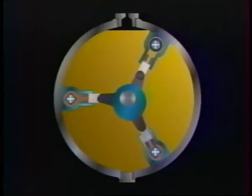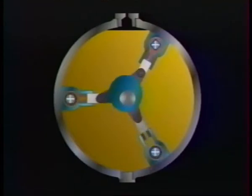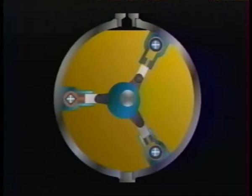The circular crankcase is oil-filled for hydraulic diaphragm activation and lubrication of mechanical parts. The Harben tubular nitrile diaphragm, with its internal supporting mandrel, allows cycling rates in excess of 1,000 per minute and produces a cylindrical pumping chamber ideally suited to high pressures. This cross-section of a cylinder demonstrates the function in full detail.